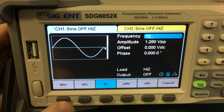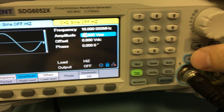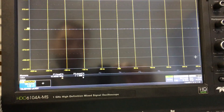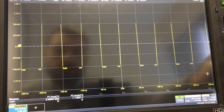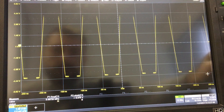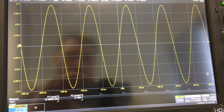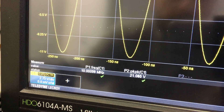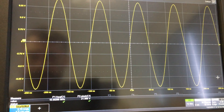Let's go back to 10 MHz to have the maximum voltage, then we activate the channel and move to the oscilloscope. It's probably not the best camera transition but the best I can do today. Here we have 10 MHz and 21 V peak-to-peak — so far so good. Let's move to 50 MHz.